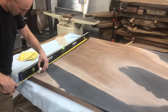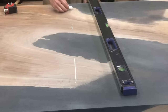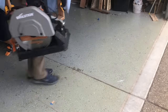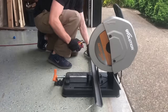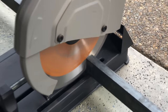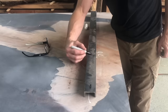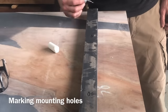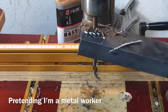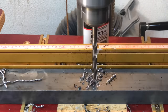On these wide slabs like this one — because this one did span the entire 44 inches in some places — I decided to add some Canadian Woodworks style C-channels. The ones I had today were actually ones that I made myself, though I usually prefer to order them from Concept 13, who is affiliated with Canadian Woodworks. To make your own, it's just some regular two-inch by one-inch by quarter-inch C-channel, cut to length. The nice thing about making your own is you get to make them the exact length you want and cut the holes exactly where you want them. But it is a mess — I really prefer just to have the ones from Concept 13.